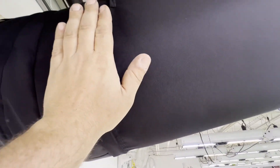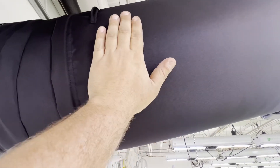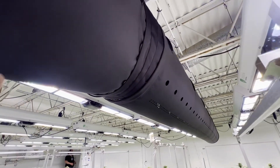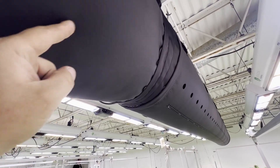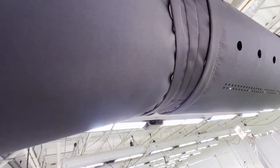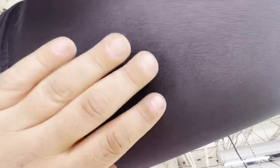Why is that? This duct is permeable. We have a CFM or two per foot coming through the duct everywhere. What that does is encase this fabric duct in a force field of air that is the same temperature and humidity inside and outside the duct. That's going to keep this environmental air, which has a very high dew point, from coming into actual contact with the cold duct.